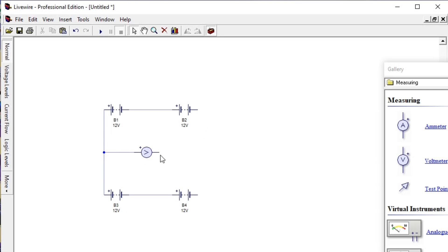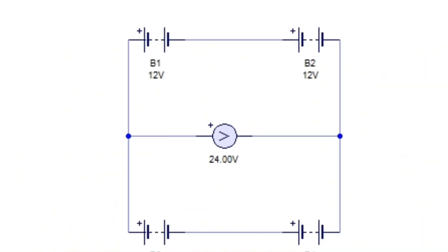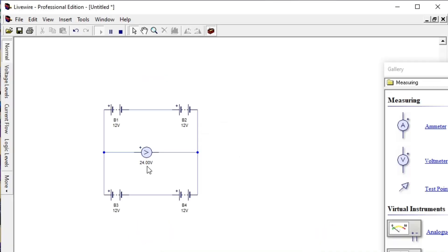Because we are using a direct system, we take this one here, we take this one here, so all of them are coming here. We take this one here, we take this one here. So this is our voltage — let's run this and see what we get. We've connected this one in series, we've connected this one in series, the output is connected in parallel. Let's run it — and you can see our output is 24 volts.